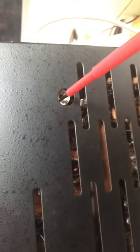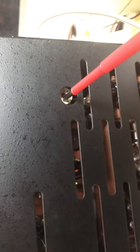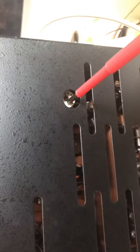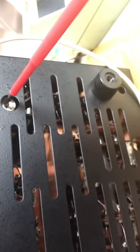The crystal is so bad from fixing it that when I first got this receiver, this potentiometer was skewed about 90 degrees the other way. So I'm just on the limits now of what Drake considered acceptable. If I turn it further, that's where it was, and I don't have much further to go — I'm within 500 to 300 cycles of having no more limit. Anyway, that finishes the rebuild and fix videos of the 100 kHz crystal calibrator inside the Drake R4B.